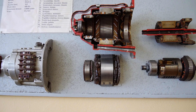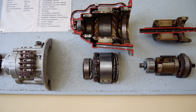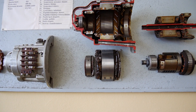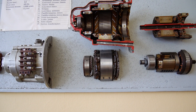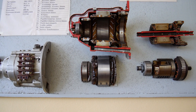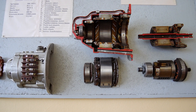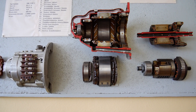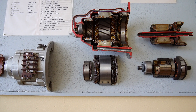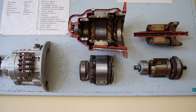Good day! In this video we will continue to talk about brushless AC generators. If you remember, there are life-limiting factors. In AC generators we have two life-limiting factors: brush wear and ball bearings wear. However, in brushless AC generators we have only one limiting factor, and this is the ball bearings life, because brushes do not exist here.